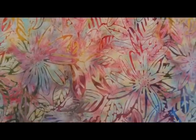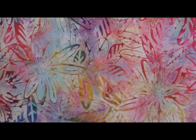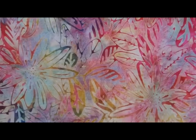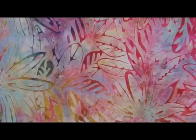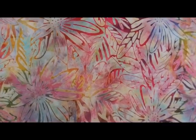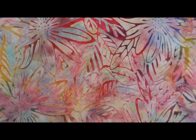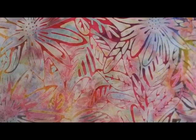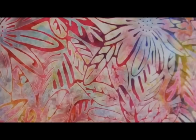All the production processes have been completed. The fabric has dried in the sun one final time, and the fabric is finished. Look at how beautiful it is. If you look carefully, you can see the ground colors made up of dyed tan with tints of the sprayed blue and red colors. You can also see the blue, red, and yellow motif colors that were sponged on earlier in the production and then bleached out from everywhere except those areas protected by the wax. It is just a beautiful design. I think you can now appreciate the many steps it took, and the toil of all the workers involved, over almost two days, to produce these few bolts of batik fabric. I really enjoyed working on this documentary. I hope you enjoyed our brief journey together and learned a bit about how batiks are made. I am working on designing a new line of batik fabrics, and looking forward to my next trip to Indonesia, getting my hands dirty with dye, and making some beautiful fabric. Until then, cheers.